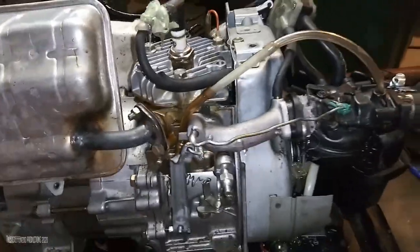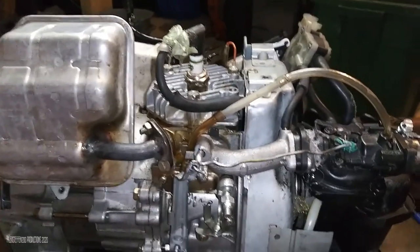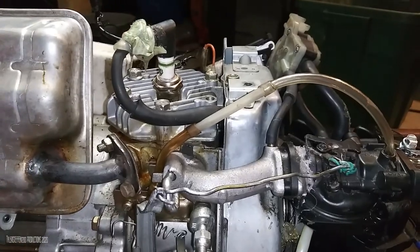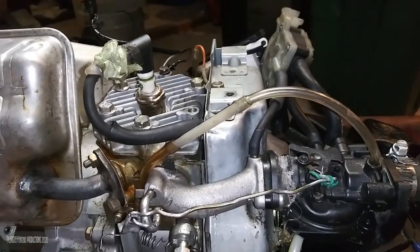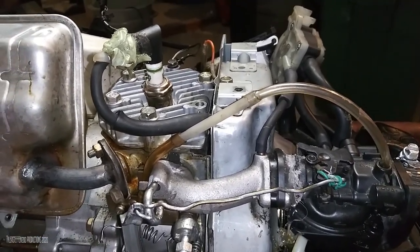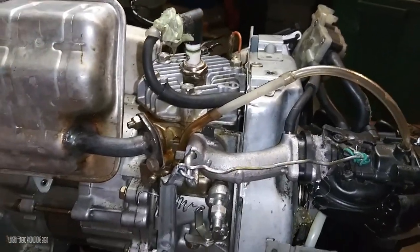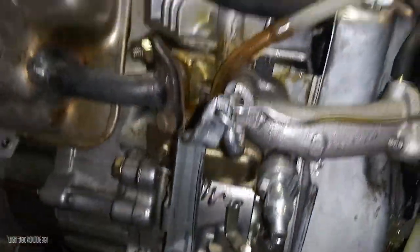This is like a Yamaha universal series light-duty motor. Yamaha made these for leaf blowers and small applications - it's a very compact flathead engine that was universally applicable for vertical applications. It's a very decent flathead engine. The valves I've reseated and resealed because it wasn't making good compression with the original valves - I used a much higher quality seal gasketing on the valve so now it's sealing properly.